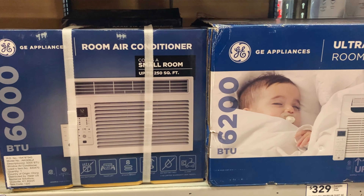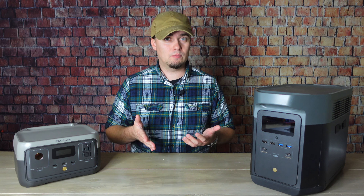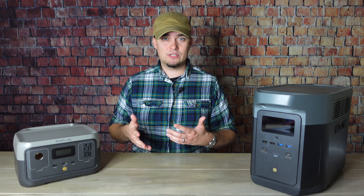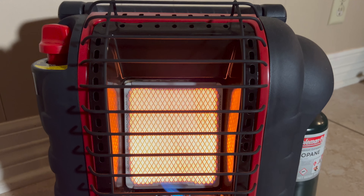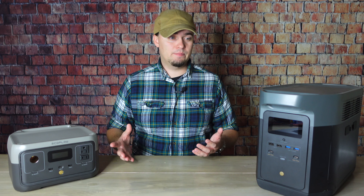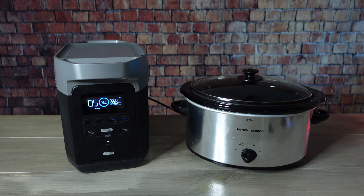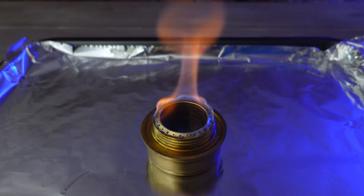It's important to understand that things like air conditioners and heaters use power very quickly. Even a mid-sized standalone power station might handle a small window AC unit for around three hours — but that's probably not the best use of your power. Having battery-operated fans when it's hot, or propane buddy heaters when it's cold, will let you handle climate control while saving your stored power for when you really need it or for more important devices. Cooking uses a lot of power too, but it's more doable if only done occasionally or for a short period of time. I recently did a video showing several ways to cook off grid, and you can find that by clicking here.